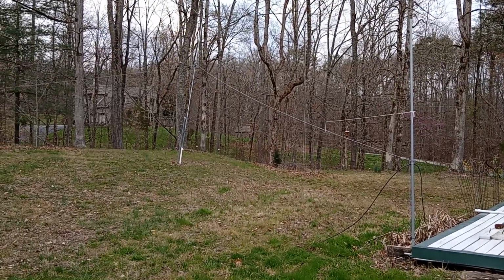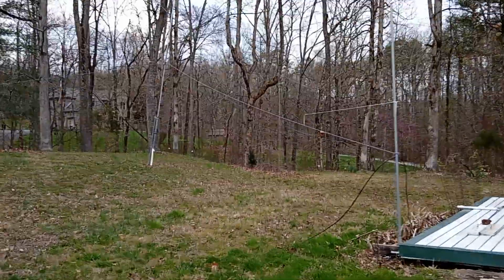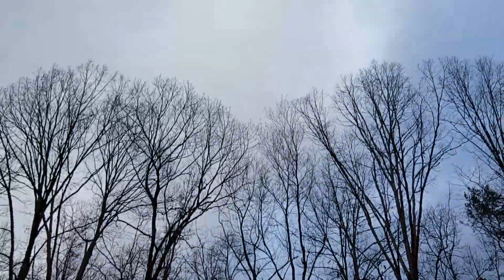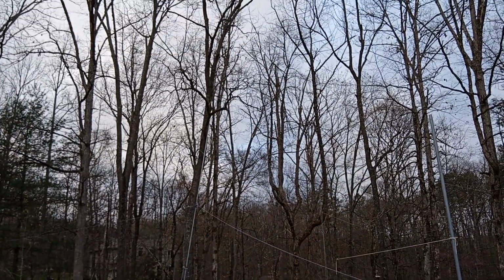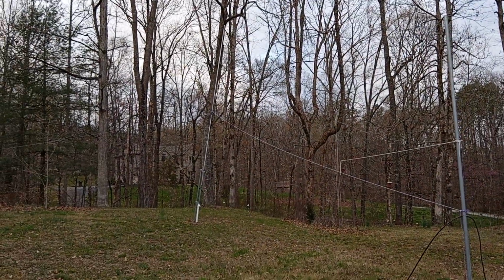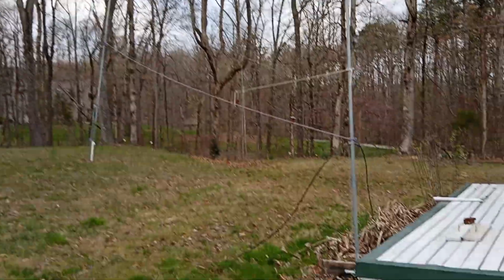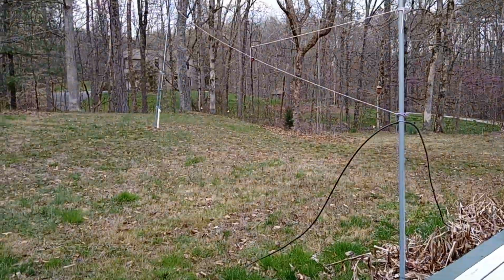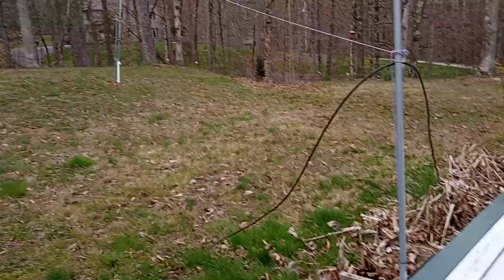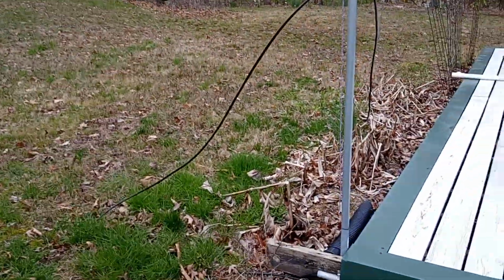Grounding that vertical turns into a lightning rod, because what those charges up in the clouds are looking for is ideally the sharp top of that antenna that's grounded, so charges from the ground can travel up to that sharp point. It is a complete contradiction in terms to ground an antenna for lightning. Since it can't be done, here's what I did.